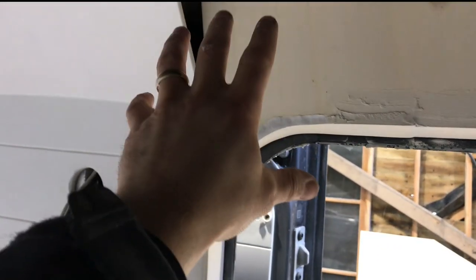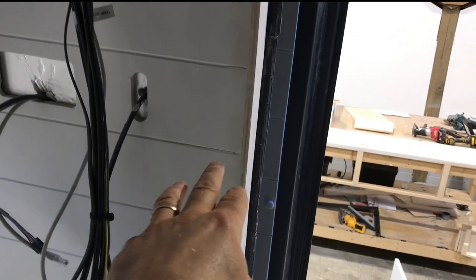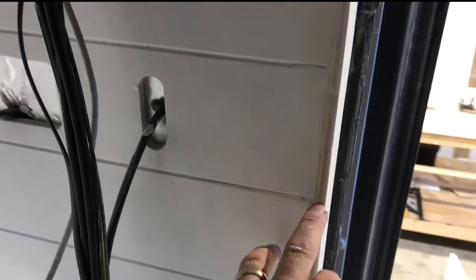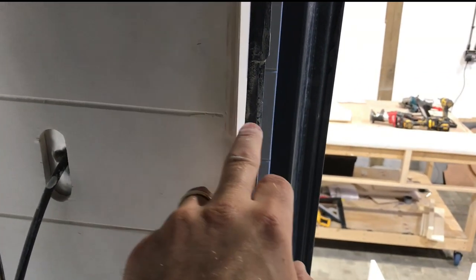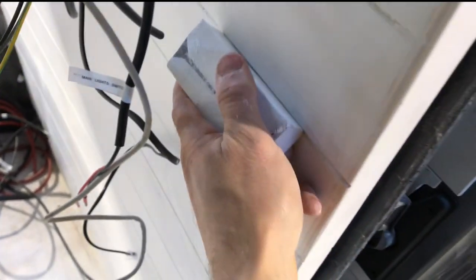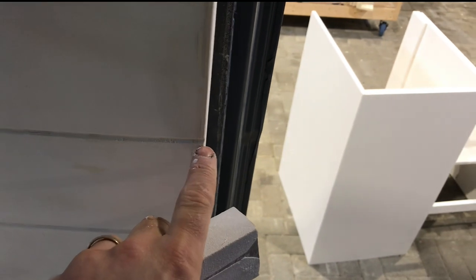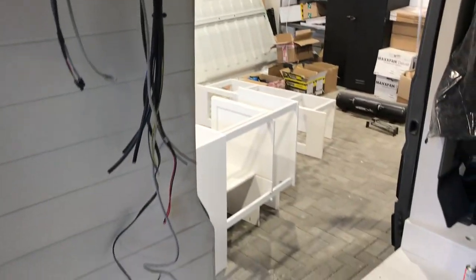This piece here is going to get hidden by the overhead cupboard, but we are going to have this bit visible, so we've got the filler here and the end grain of the plywood is nice and smooth. We're going to continue this groove here — we sand the groove out using a sanding block, which is just a block of wood with some 120-grit sandpaper, and that continues the groove all the way to the end grain of the plywood. Once it's painted it will look lovely.